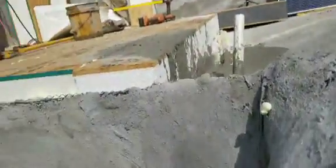So the aircrete, which has the foam as a dispersant, finds the cracks, is slowly seeping through in the bottom. So that's one of the worst things that can happen in a form for aircrete, because nothing can really set above it because everything's slowly moving from a slow drip. So I tried to add some foam right now, and that might have some effectiveness, but it's likely this will droop a bit. But also less of it got down in there than I expected.